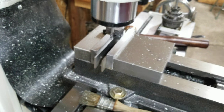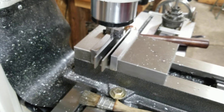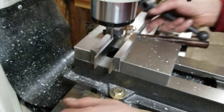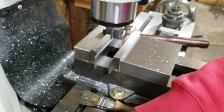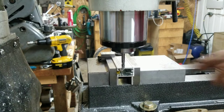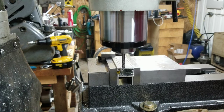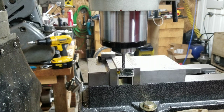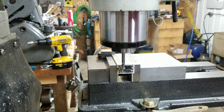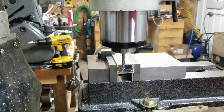We're going to try to clean that up a little bit. I'm going to use this little chunk I cut off here — this is the first cut I did — and I just want to see if I can't straighten that out a little bit. I'll use the little quarter-inch end mill and do it in two passes. Honestly, I don't think this has a whole lot of bearing on the functionality, but we're going to go for it anyway. First pass, no glass.